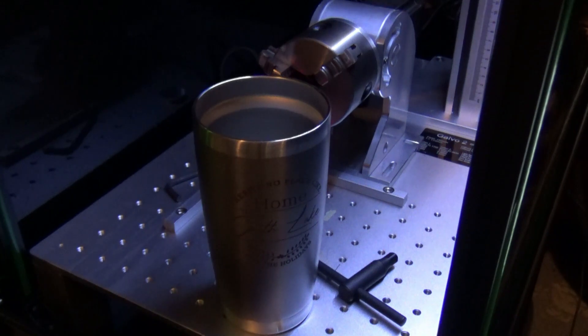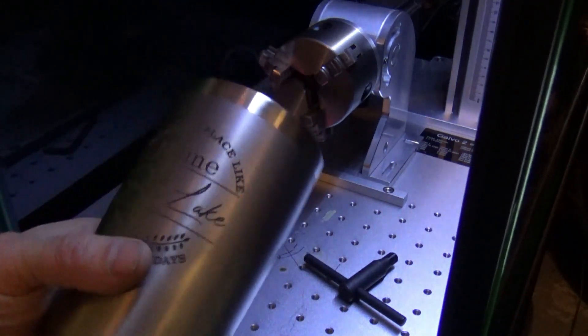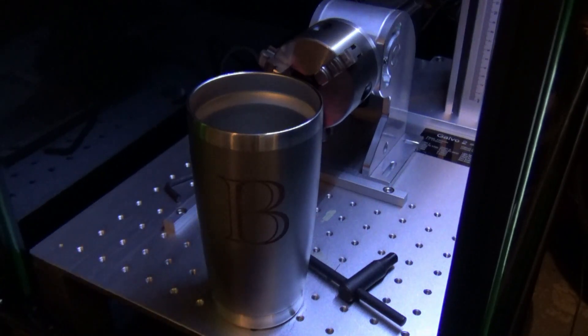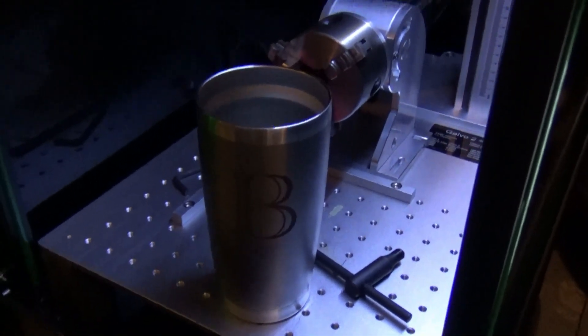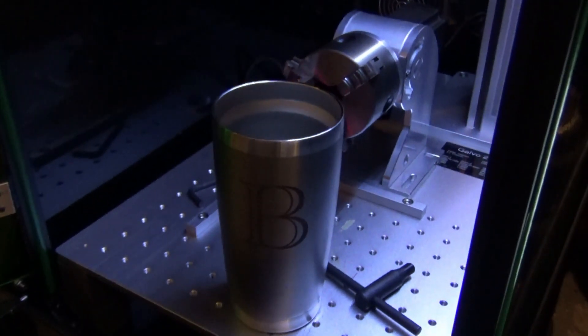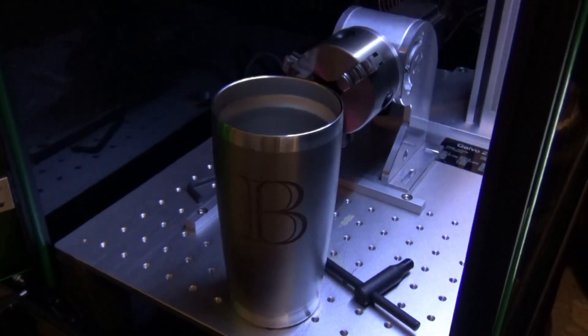The new enclosure works really well when you're doing this kind of etching — you're basically vaporizing the material, some of the stainless steel as well as the powder coating, so it'll leave a metallic taste in your mouth if you don't have good ventilation. The fan is doing a really good job of exhausting all that vapor. I can see there's a film inside the cabinet and dust on top of the laser, so it's definitely exhausting all those fumes.